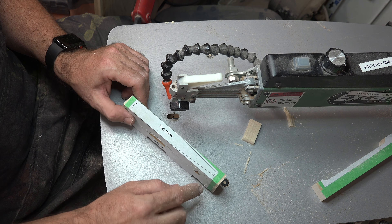With one surface of the wings sanded, it's time to assemble what we have. First, mark the center of the bottom of the plane's body — just a small tick mark front and back. Making sure the front face is facing forward, apply glue to the wing, line it up, and place the front wing in its groove and the rear wing in its groove. Clamp it up, clean up the squeeze-out, and let it set.